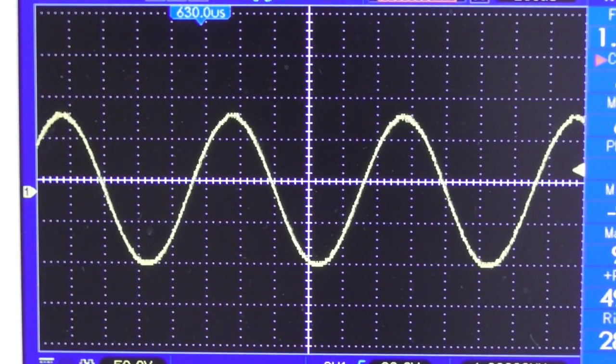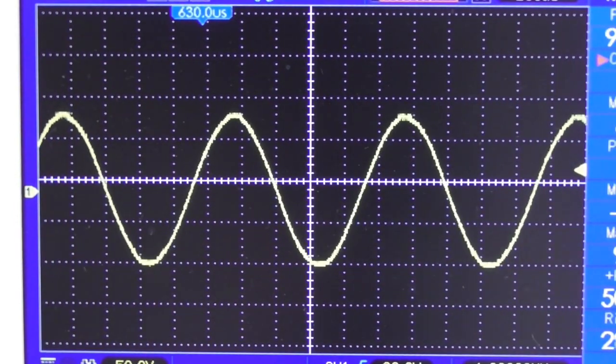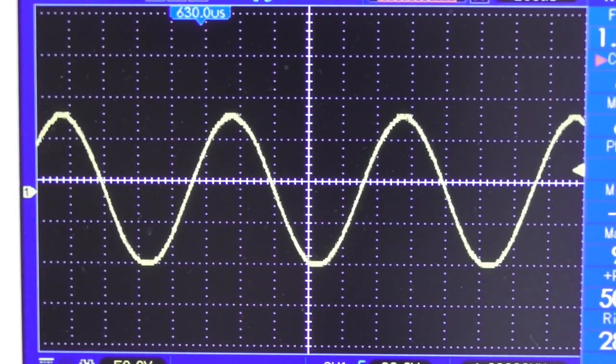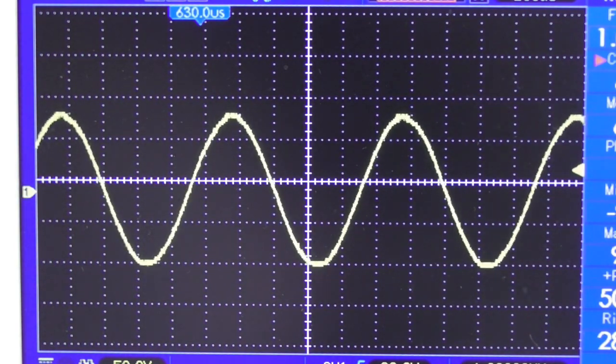Here we're looking at the maximum output. Now all these voltages initially are going to be with 20 volts DC applied, and that is actually giving an output of 6.4 volts. And to get that 6.4 volts, you need, let's just have a quick look, we'll measure it. You need about 1 volt going in, so that's really a gain of 6, isn't it, not 5.